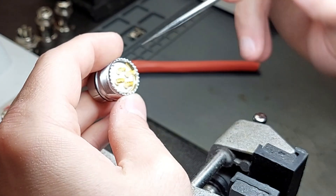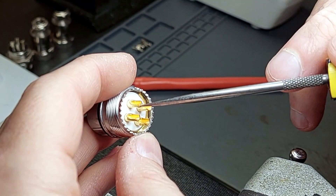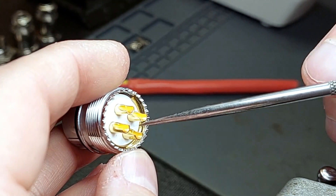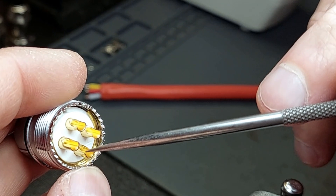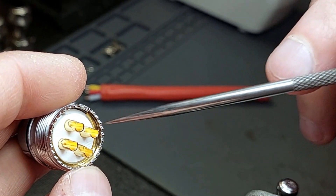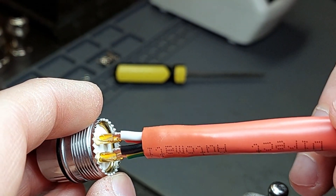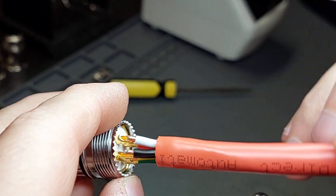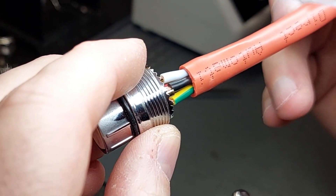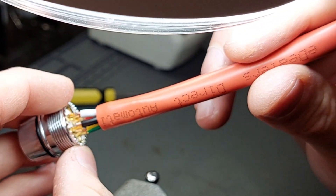This one's really unique because many of you just getting involved with the niche are finding out that your ground is basically diagonal of pin one. So what does that mean? It means it's very difficult to stretch out all of your terminals to get the cable in the correct position for grounding properly. You can see how everything aligns, but you cannot solder without being in very close proximity to the other conductors.